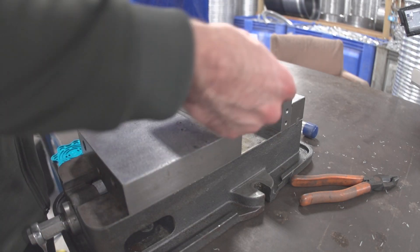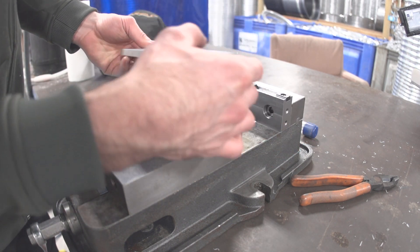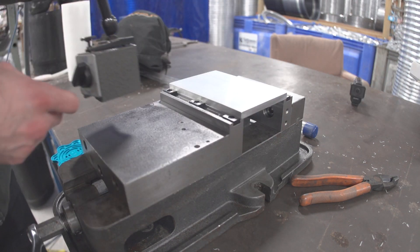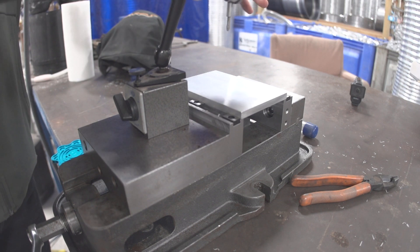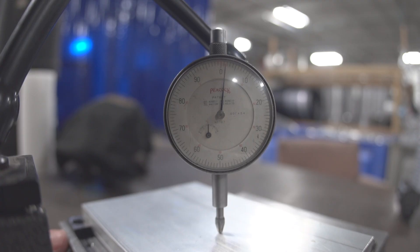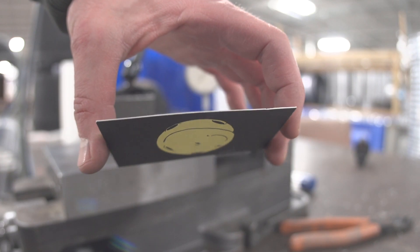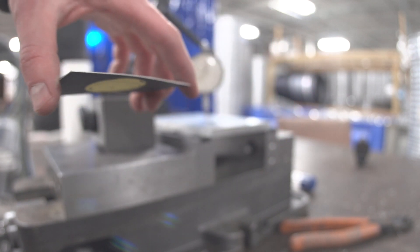Step one, obviously we're going to load the material into the vise. I've got these Mighty Bite jaws, which work great because they just barely grab the bottom edge of the material. Now, to illustrate the first problem, I'm going to put this mag base clamp onto the vise and indicate the middle of the part. When I tighten this down — see what's happening? As I squeeze it, the middle of the part is actually bowing up. Imagine doing the same thing with a business card — when you squeeze the ends, it bows up in the middle. Same thing is happening here.